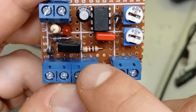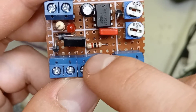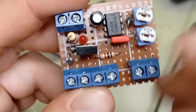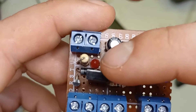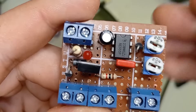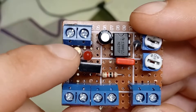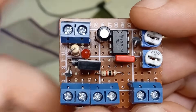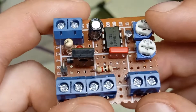And you want at least one 1k resistor — brown black red gold, although gold is the tolerance; brown black red is what you want to be looking for. What I also like to do is have an LED connected to the output of the circuit, so this will flash whenever the solenoid opens. If you don't want that LED indicator you can get rid of it, and you can also get rid of this 1k resistor, so you will only need one which is just for the base of the transistor.